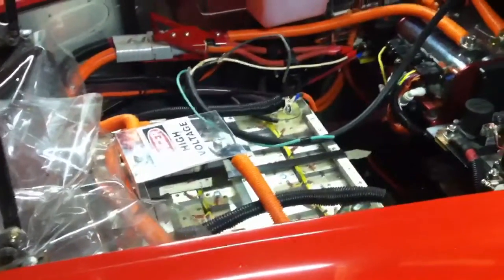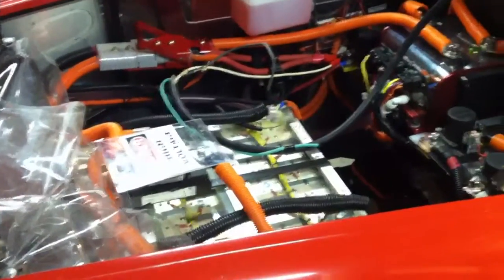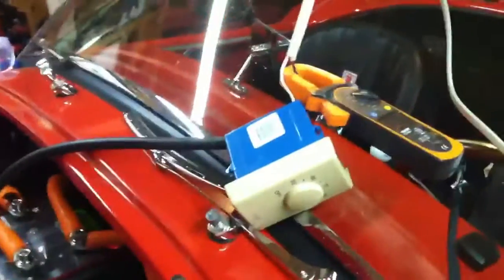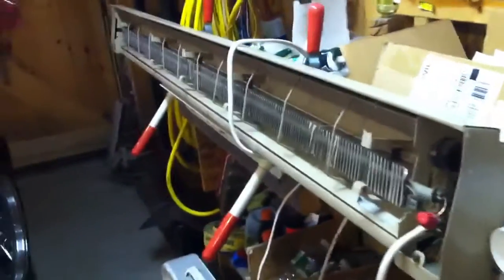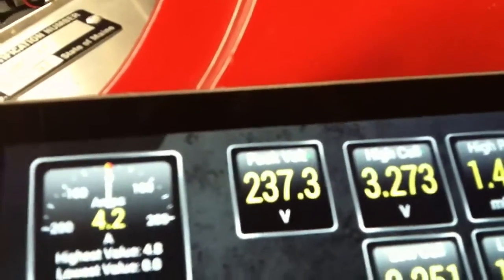I've also decided to drain the batteries off a little bit to let them down to rest at a lower state of charge, which is a little bit better for them. So I've hooked up a small thermostat here and a piece of electric baseboard that's running about a kilowatt or so, adding a nice little bit of warmth to the room. You can see where that's drawing about 4 amps at about 237 pack volts right now, so the voltage is coming down. It started out at about 240 or so, so it's been slowly draining, and that'll let those batteries rest for the winter.